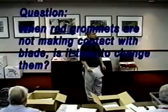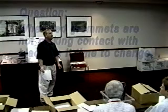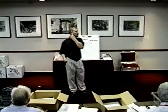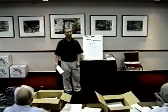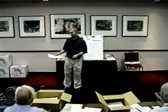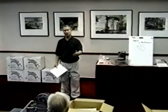Going back to the red grommets: once you start seeing light between the red grommet and the blade, it's time to change them — though you can go a little bit longer. For the price of a grommet, it's worth changing them a little earlier to save your blade. When you buy a saw you get extra red grommets — enough for the life of that blade. Every time you buy another blade kit you should have enough as well. If you're replacing them every hour and there's nothing wrong with the saw, it means you're pushing really hard. How the wear on a red grommet shows up will tell you what the problem is — that's a good indicator.